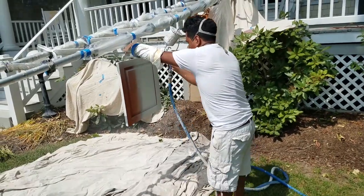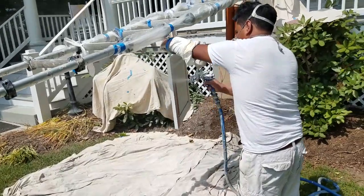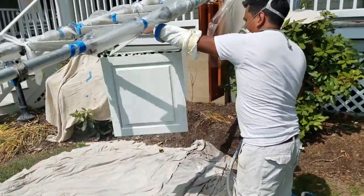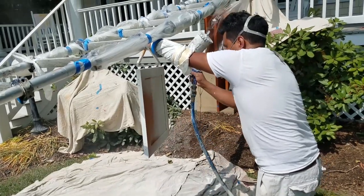It's just the fact that it's a shellac, and shellac fuses with the lacquer finish. So it's not bonding to it, it's actually fusing with it. So it can't come out. It becomes one with the lacquer. And it dries great, which is super cool, but it can be difficult to work with because it dries so quickly.